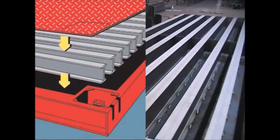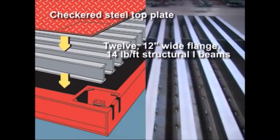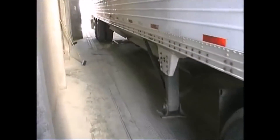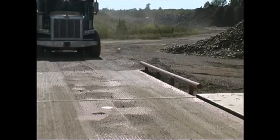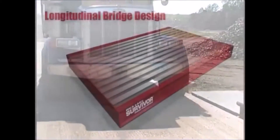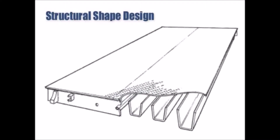The weigh bridge on the Survivor OTR model is made of diamond checkered steel tread plate. The tread plate is welded on top of 12 inch wide flange, 14 pound per foot structural I-beams. Rice Lake positions these massive beams longitudinally with the traffic flow. No matter where the tires are positioned on the scale, each tire is fully supported by the top plate with a wide flange beam below. Rice Lake's longitudinal design is based on highway bridge designs that are intended to last 100 years or more. This eliminates the longitudinal ruts associated with designs using structural shapes instead of heavy bridge iron.